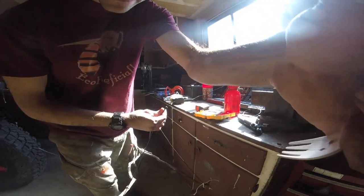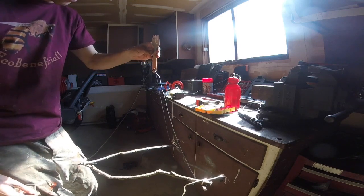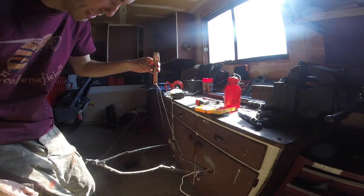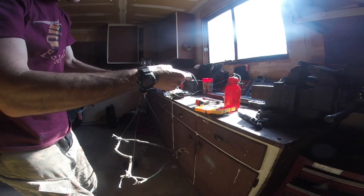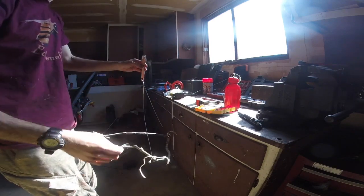Here I've got the 3 wires joined and through the loop. You can attach some super glue or however you want to hold it in place. Now I'm going to attach the radiating element — I'll take the last piece of wire, strip the ends, and route it through here and then to another insulator.